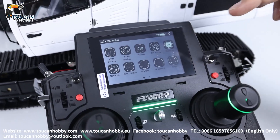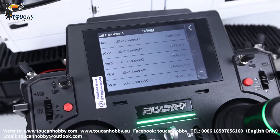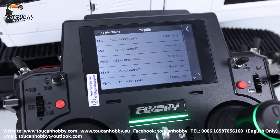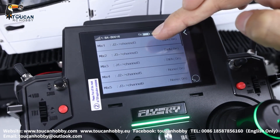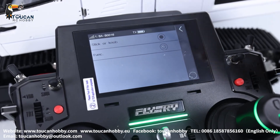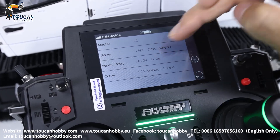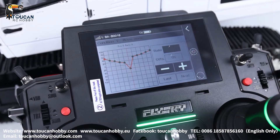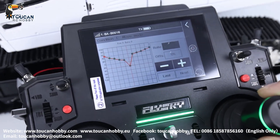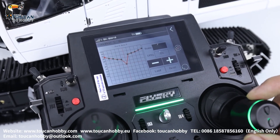Let's go to see the mix control — go to ProMix. First, the pump. The big arm, front arm, and bucket mix controls the pump. Pump is channel 3, so master is J2 — that's the arm — and slave is channel 3, the pump, with a control curve. So to raise the pump: the pump starts quickly, then slowly raises the load.